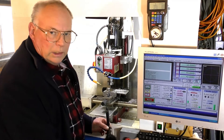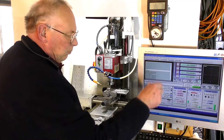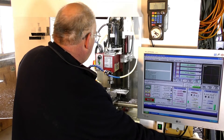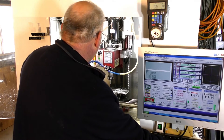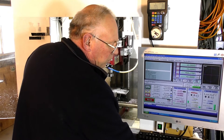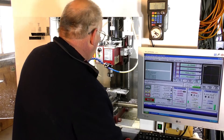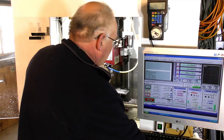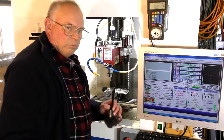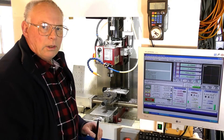So that was up one, incidentally. If you want to not use a pendant, it's fine — you can just use a keyboard to go up in the Z, just press nine, that'll take you up. Three is down. Four is X across that way, six is X across the other way. Eight is Y back that way, two is Y back towards you. So you'll have full control on the keypad as well.